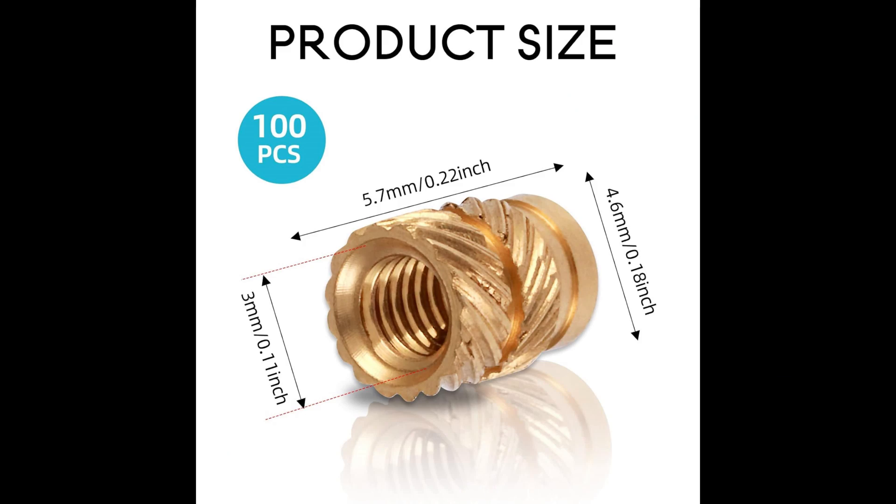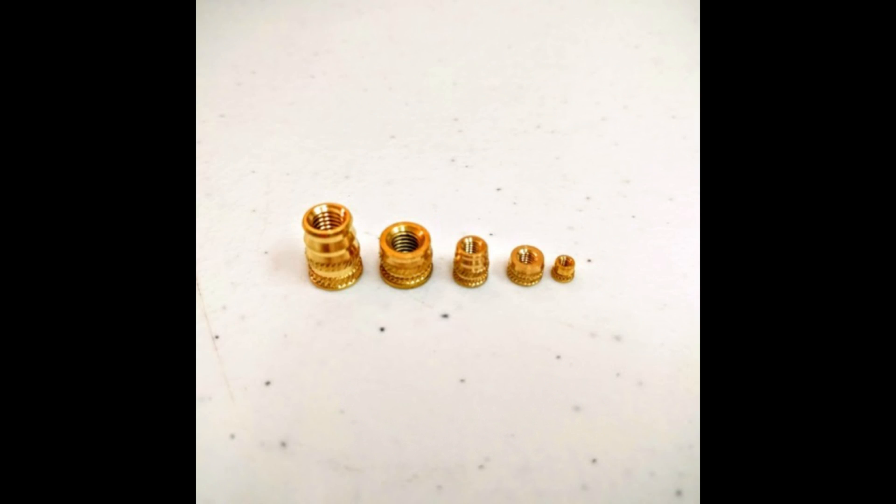Before we demonstrate how to place one, let's review exactly what these are. These are a piece of brass that are machined. They have a threaded machine thread on the inside, and on the outside are knurled bars. When these are heated and melted, they are basically surrounded by molten melted plastic, and when it hardens, you can see these are in a counter-rotating basis so they can't be turned in or out — they really hold securely. They come in many sizes: two and a half, three, four, five, and six. They come in a variety of shapes and they're incredibly useful, particularly in putting together 3D printed parts.